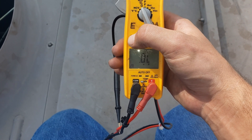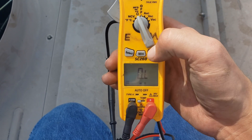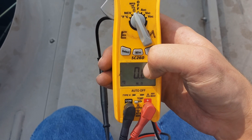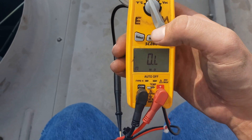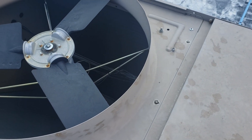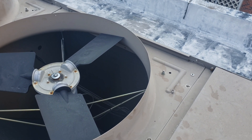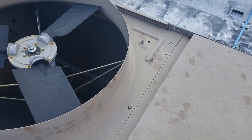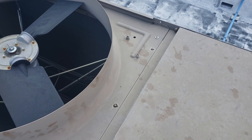With a meter like this, when you're manually selecting, let it go to auto range. On auto range it's showing millions of ohms, and that will actually adjust whether you have millions or kilo ohms or whatever. On my personal meter — a bench meter or block meter, depending on how you want to call it — I can manually select the range of my ohms. Anytime I'm ohming something out like this, I always start at the highest range, and if I see zero ohms, I step the range down until I get an actual usable reading.